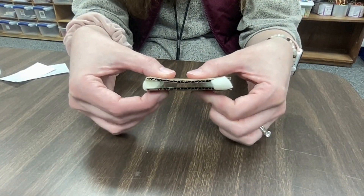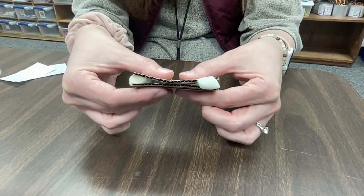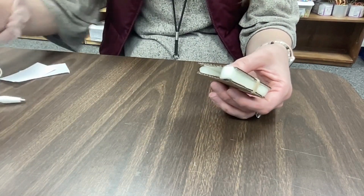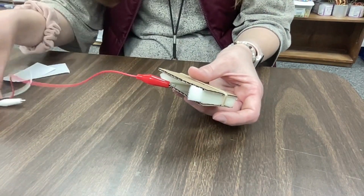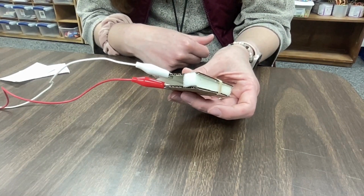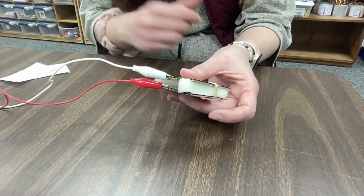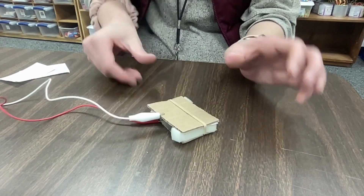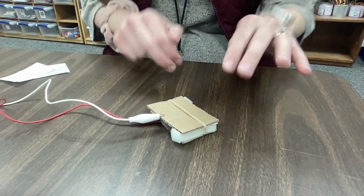Now it's kind of all held together. If I press down you can see the aluminum tape will touch, and that's where the pressure switch comes from. But let's hook it up to see how this works. My earth cord I'm going to put on one side of the pressure switch, and my spacebar will go on the other half. Notice my circuit is still open because the aluminum is not touching — the alligator clips aren't touching, and all of my insulators are preventing them from touching. But now to close my circuit all I have to do is press down and it should close.